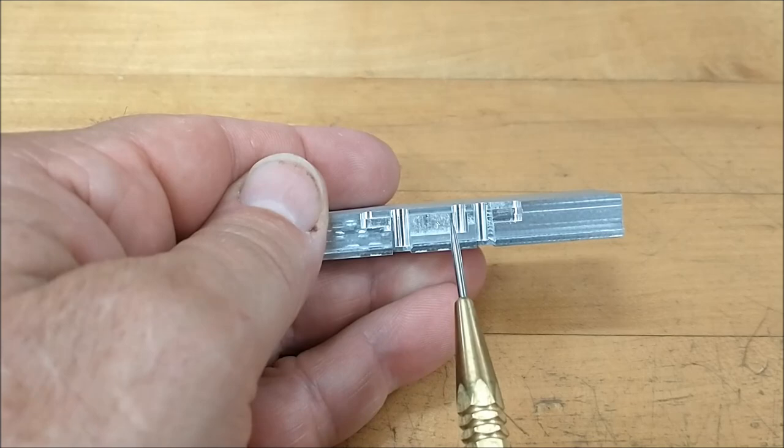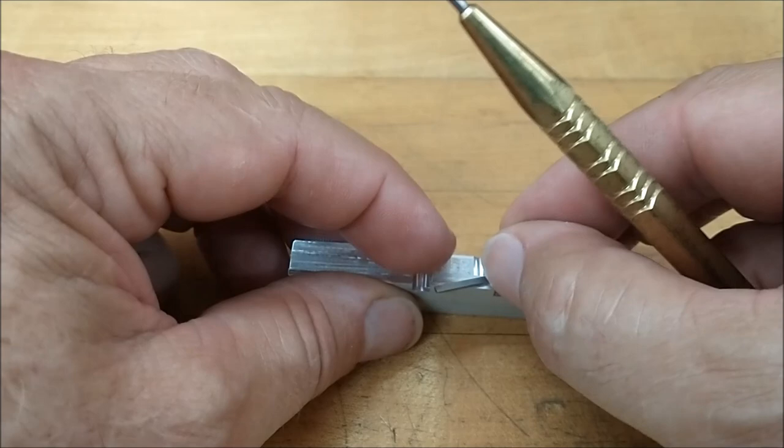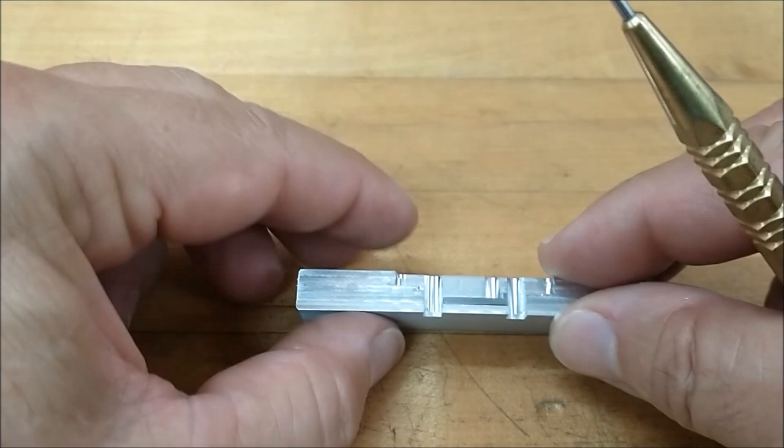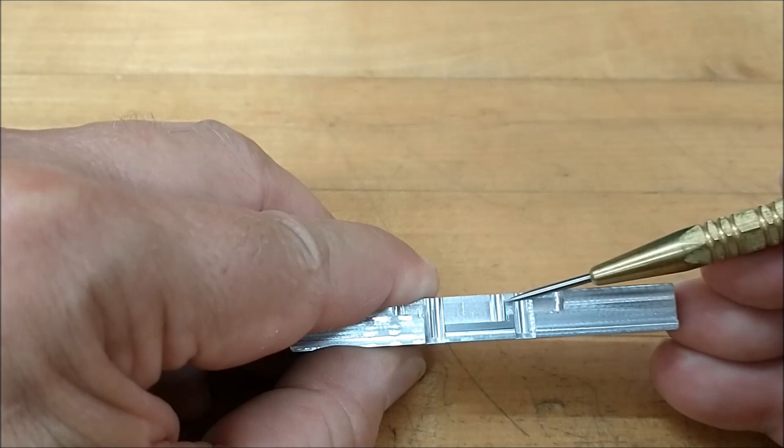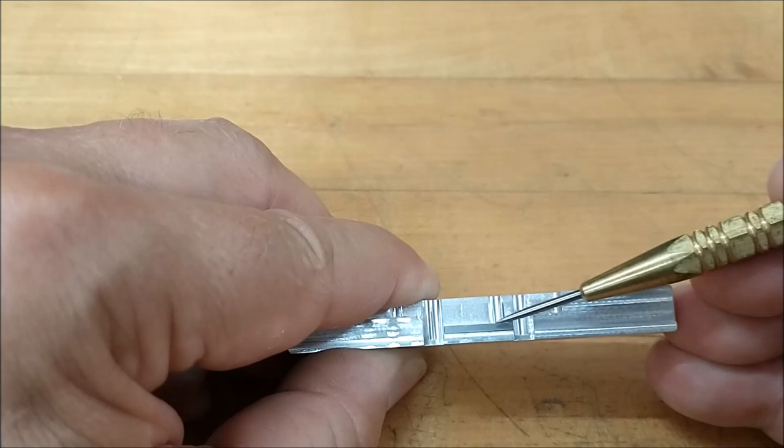Now let's put the part in here. This is a little guy. Come on. There you go. Now with a rough Z height established, I knew exactly how far down I had to move to get the overall height of the part. That's good, because once you have this plane, then you know how far down you move to get this one. That's an easy Z adjustment, okay?